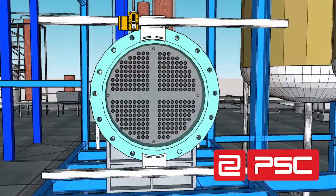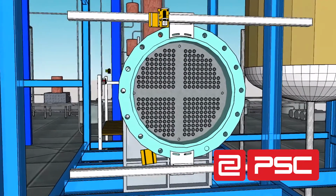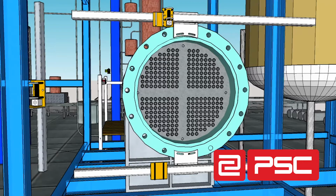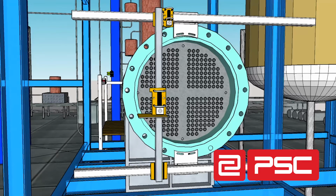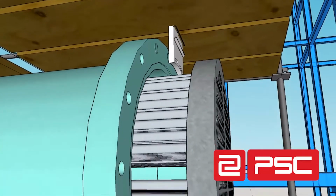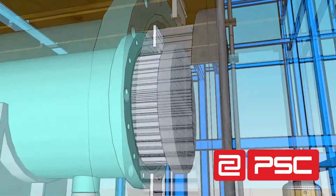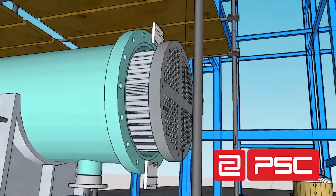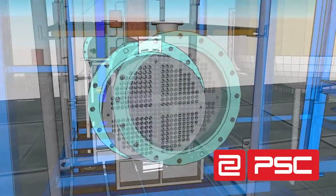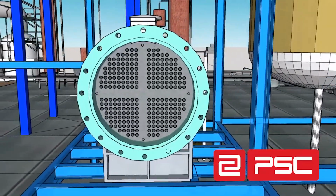This video will walk you through the process of installing the Flexframe CIP system and 3XLTC on an exchanger using basic flange adapters to hold the automated cleaning equipment and indexer. The basic flange adapter should be used when installing the CIP cleaning equipment on an exchanger face that is flush with the flange or slightly recessed so that the indexer works properly.